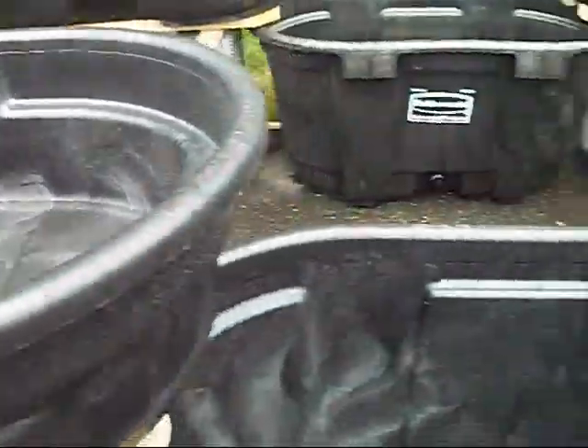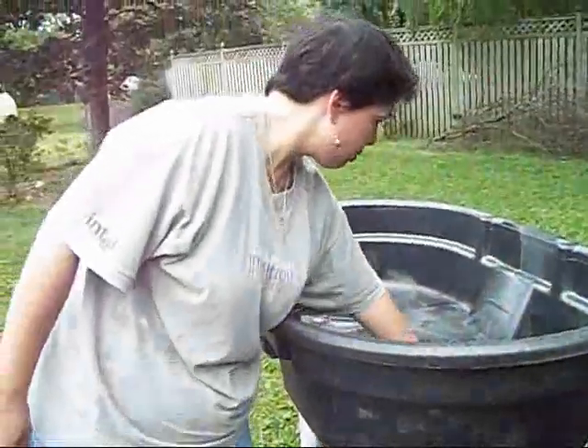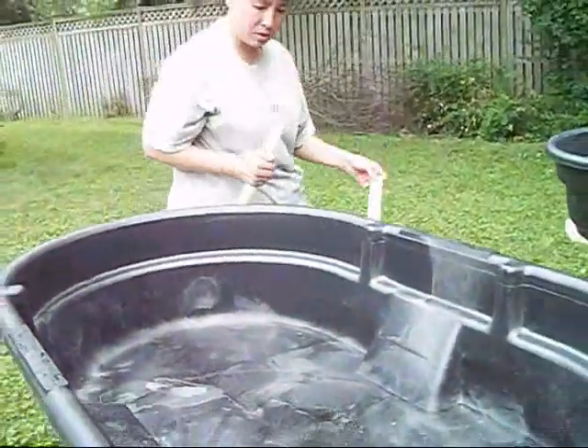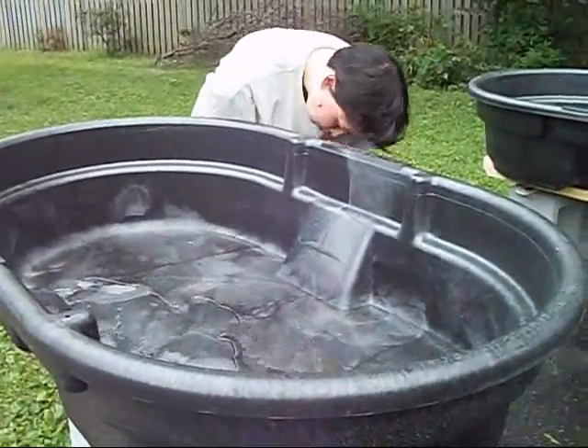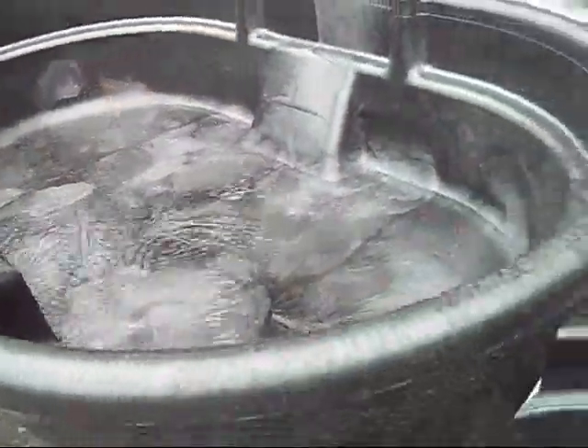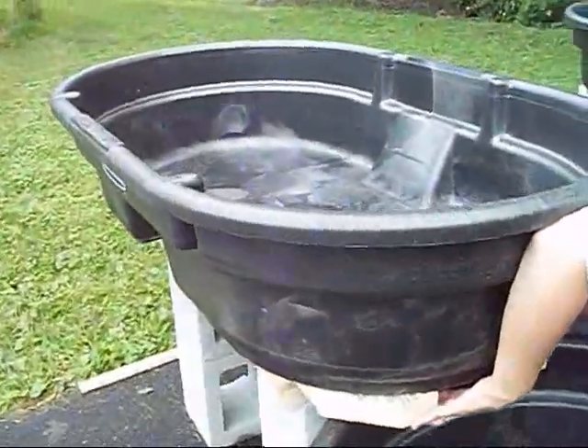The third one has a lot of water down here and not so much there. I do have a 1x3 in here that I can take out — let's see what that does to it. It makes it better. Pretty good. Last victim — if you're really concerned, I can see this one is ever so slightly to one side. I have shims and I could use them to bump up the level on one side relative to the other. And that's pretty even now.